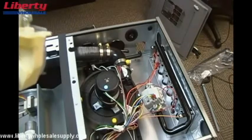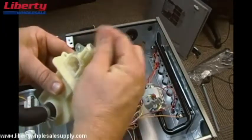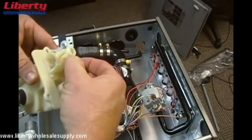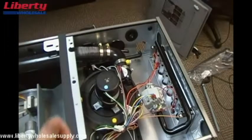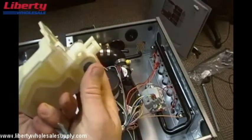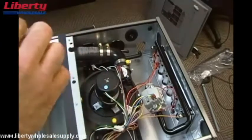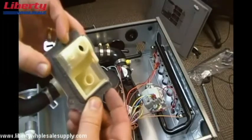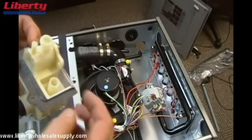For the next step we're going to go ahead and configure our condensate trap. First thing we need to do is pull this plug off and discard it. There's a metal bracket that was holding it in place — pull that off and discard that as well. Take the plug that came in your RXGY-CK kit and install it in the back of the trap. Next, take the gasketing that came with the kit, install that on the top of the cabinet, and then install the trap to the jacket.